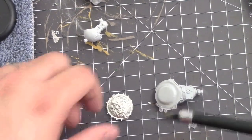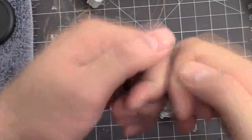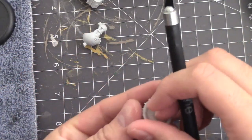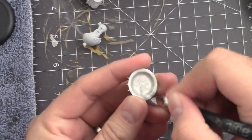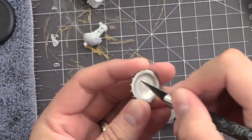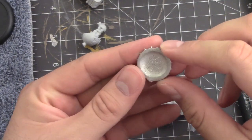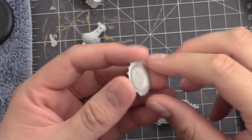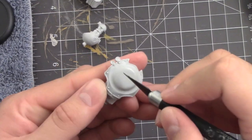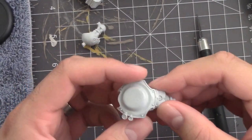One tip I picked up when working with metal is scoring the side that's going to connect. Those little scratches help align the bits, and instead of a super flat surface, the super glue gets into those cracks and tightens and seals in there. I'm going to score this up just a touch — taking the X-Acto knife and creating scrapes on the inside in an alternating pattern. You don't have to go crazy with it. Do the same on the other side — just a couple of abrasions to create gaps for the glue. It's not strictly necessary but it does help the models stick together better.